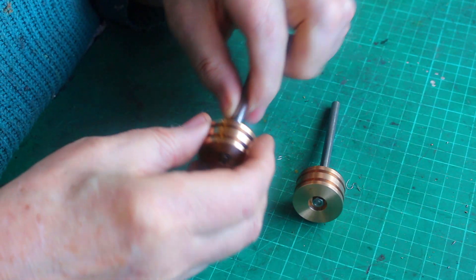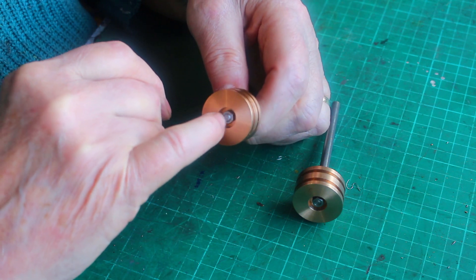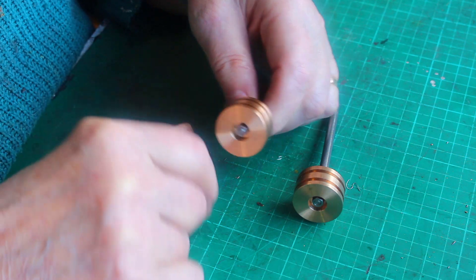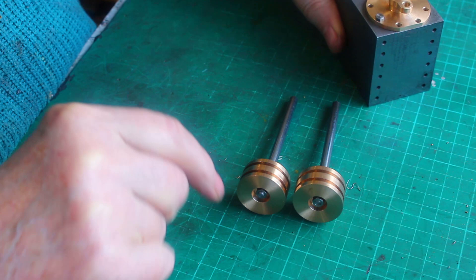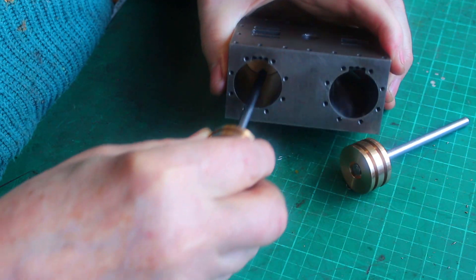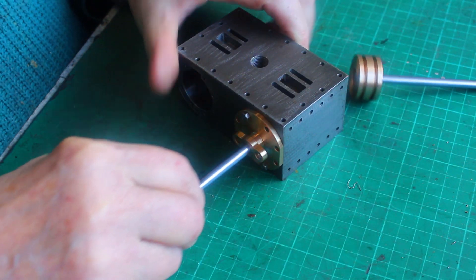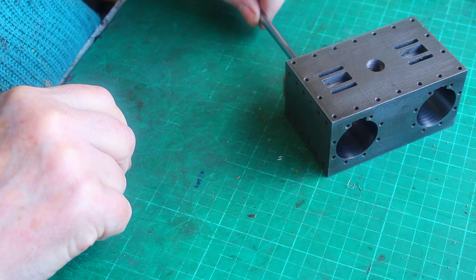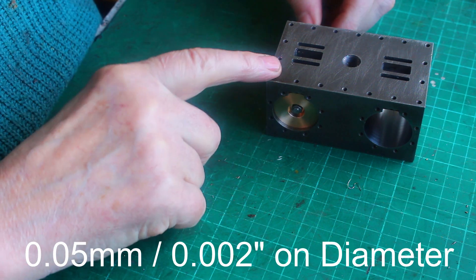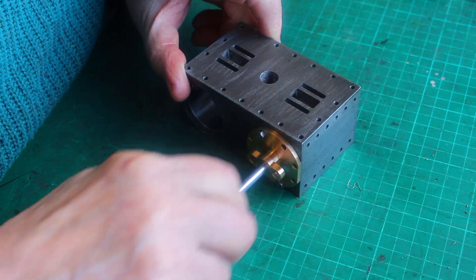So that's the pistons complete and fitted to the piston rods. It's a critical component but very simple to make. I will make some custom locker nuts to make sure that these nuts don't come loose on the final assembly, which I'll cover in a future video. So I've temporarily fitted one of the backplates on the cylinder so we can give it a try and it fits in very beautifully. I've made a clearance between the piston and the cylinder of 0.05mm which I think should be okay, and it seems to be perfectly in alignment so happy with that.